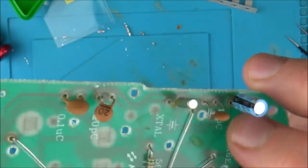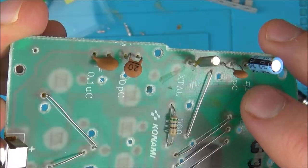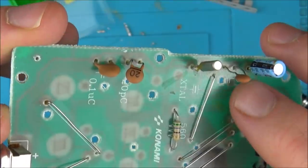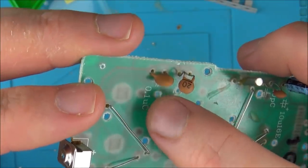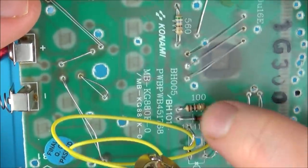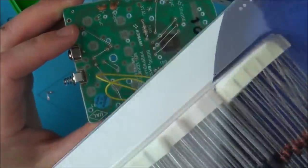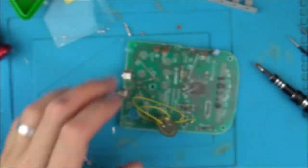These are all tiny capacitors and if you have a look it says 10pC, 20pC. From memory I think this one was 0.1 microfarad - it made sense that this was double the other one. I can't remember exactly what it was on my meter but it made sense. The diodes were testing okay in circuit but I did unsolder them just to check. I recognised the number - it's the same as the 1N4148 diode and I checked it against that one and my meter showed exactly the same.